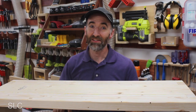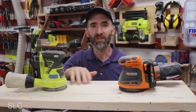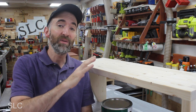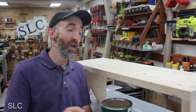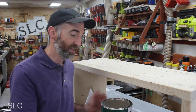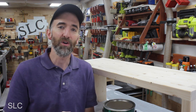If you've done any woodworking in your past, then you know it's time to sand, sand, and sand some more. We've got to remove all these high spots and get as much of this squeezed-out glue removed so we can put a finish on. With the sanding all done, it is now time to either stain it or just put some kind of a top coat on this. Because dealing with kids, even in a non-food environment, they're going to find a way to drop or spill something on here, so we've got to protect it. I'm going to use a spar urethane that is water-based. That'll dry relatively quickly, and I can just put a bunch of coats on. I'm going to use a basic brush to apply it.